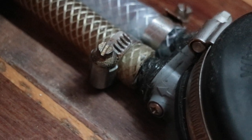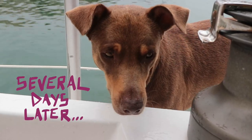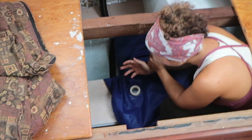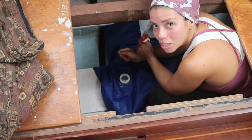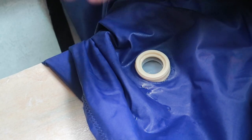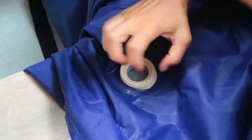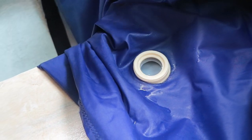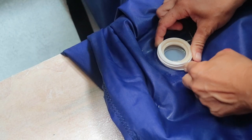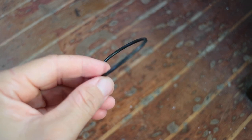We have had to so-called weld other parts of our freshwater system already — like the whale foot pump. Epoxy on the attachment points is a must. Several days later, we emptied the tank a little bit and tried alternative ways of closing this bottom attachment. I tried a little Teflon tape, but the problem is that this tank's attachment is slightly softer than the first tanks we had, and it just pops off. The Teflon tape was absolutely useless. We ended up removing the gasket between the elbow fitting and the tank opening — and oddly, that has done the trick. No more leaks, and the attachment hasn't popped off again.